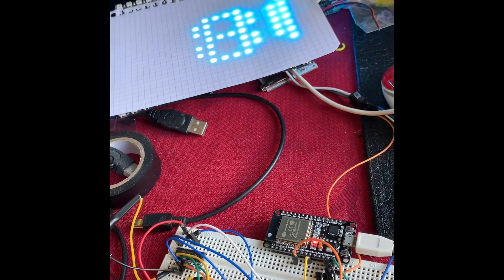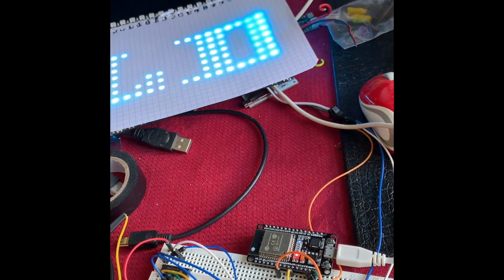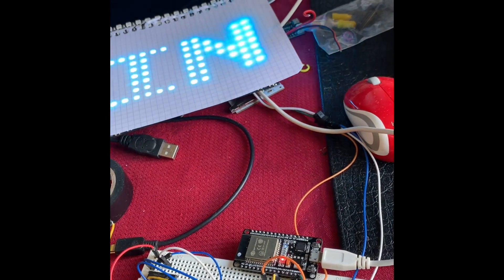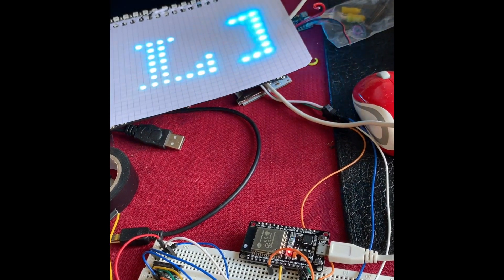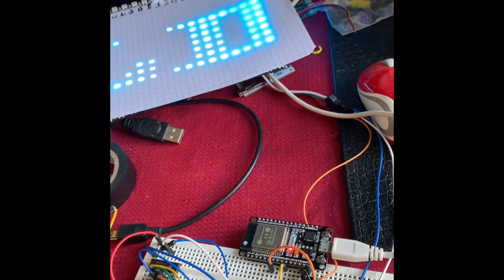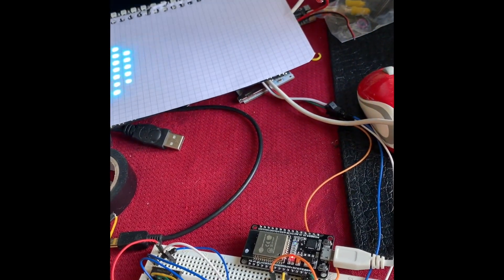Of course you don't need to go that fast, but it's really nice. If you want to control 20 strips, you will need four pins out of your ESP32 plus two — so six pins to control 20 strips using four shift registers. With a bit of electronics, four shift registers and six pins, you can control 20 strips. Each time you add one pin, you add five virtual strips.